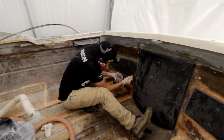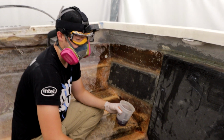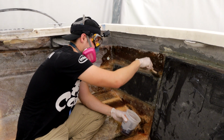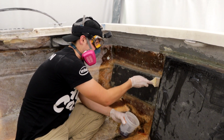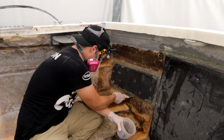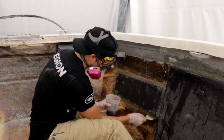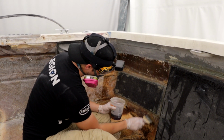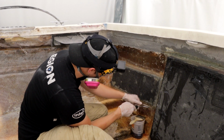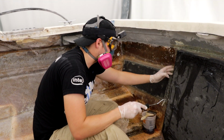Want to talk through some of the troubles? Well, it's really hard to get this fiberglass to lay flat. I almost am like, maybe we should use chop strand instead of this stuff, because I think the chop strand mat will lay a little bit easier. But yeah, it's just really hard to get it flat to make these curves work. And it's hot. It's real hot. The lights make it hot. The resin's hot. See, I can't get the air out of it. I don't really know what to do, because even a thin roller doesn't really work. And I think it might be partially because it's not 100% smooth behind this. It's difficult, but we're gonna make it work.